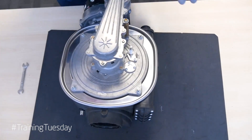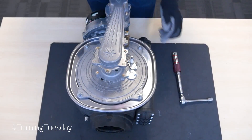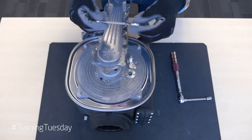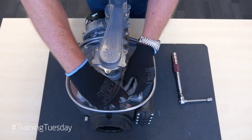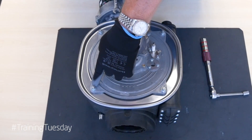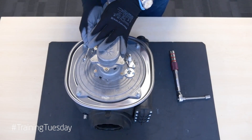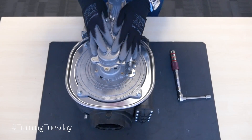If you do not have a torque wrench in your toolbox, tighten these four nuts as tight as you can with finger and thumb, then with either an open-ended spanner or a socket set, clamp them down — it is approximately three quarters of a turn. To demonstrate: going three quarters of a turn of the clock gets you to approximately seven newton meters. So as a rule of thumb, whiz these up as tight as you can with your fingers and then give each one an extra three quarters of a turn — diagonally across and then up and diagonally across — and you will have clamped this burner onto the front face of the heat exchanger to adequate pressure.